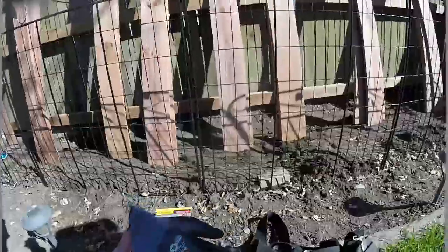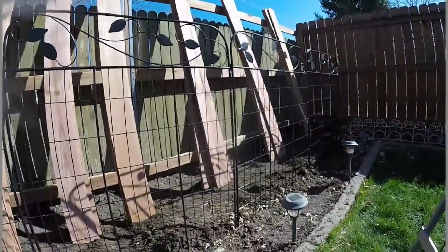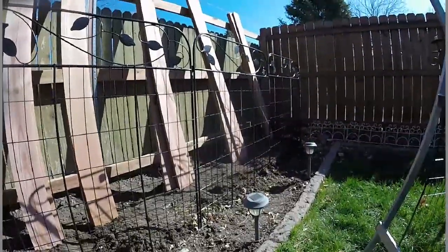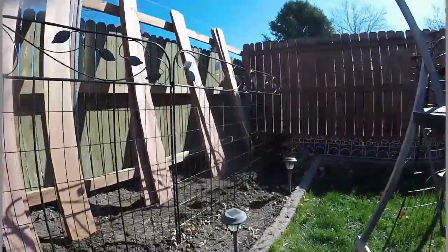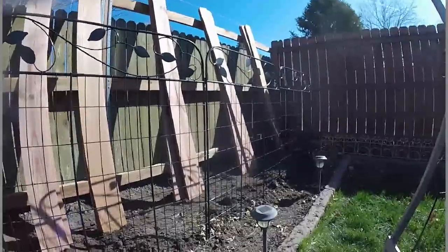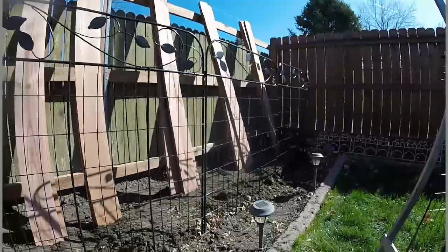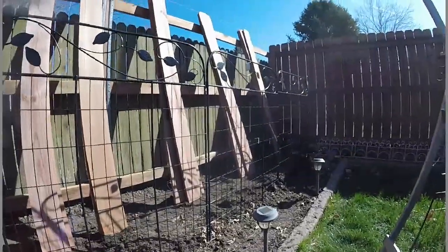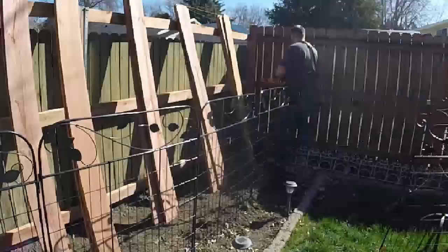And since these are pressure treated red toned wood, they kind of have a red stain in them, and they are still wet. They always come wet from Home Depot. One of my complaints. So when they dry out, they warp. Some of the boards warp pretty bad. So I still wear gloves, one to protect with using the impact and screws so I don't pinch a finger, and also to keep the red tone off of there. So I'll set the camera up and have you watch this first section, and we'll just kind of time lapse through that.